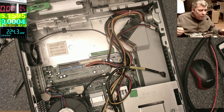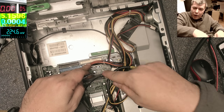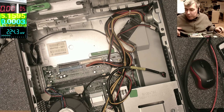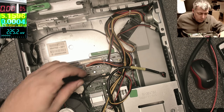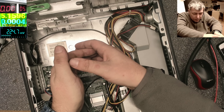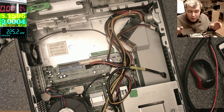If I do it manually — green wire to ground — you short a wire on the power supply and that will start the 12 volts and the 5 volts, not the standby one but the high-amperage one. Shorting the green with black, and you can see the LED and you can hear the fan — now it's working.